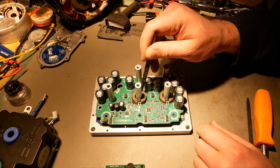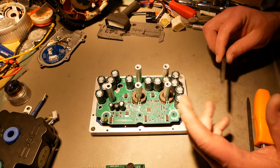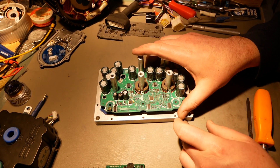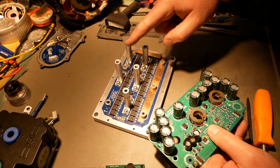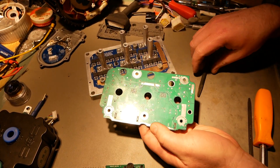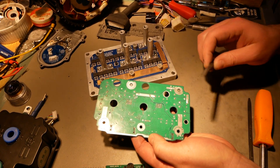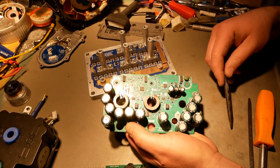These two current sensors are basically a ring of thin laminations with a Hall sensor in the center. Here are all your large filter capacitors, and back here there's a little op amp package. On the bottom side of the board there's not much to look at. The things to note: you have an RF plane right here, which I like to see. Then you've got battery minus here — it's not a current path, just going up for ripple filtering to the capacitors.